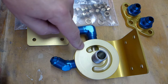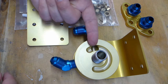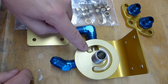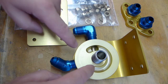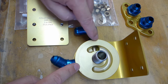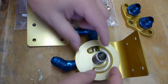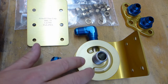This — lop off a one-inch piece off of aluminum rod, what's that, three inches in diameter maybe — drill a hole here, thread it, drill a hole here, thread it, drill a hole here, and thread it. And then just take a bull-nose bit, or a round-nose bit, and go, so this groove is in here. And that lets the oil come from here into the oil filter, and then through here. So it'll travel in through this fitting, get up into this groove, go into the filter, and then back out here. Or vice versa — I don't know which direction it goes. So that's pretty simple too.